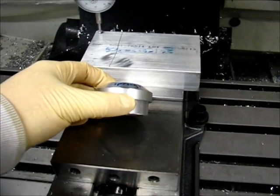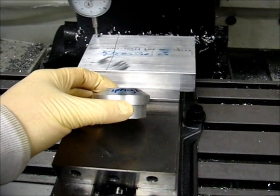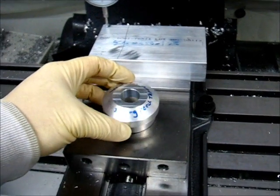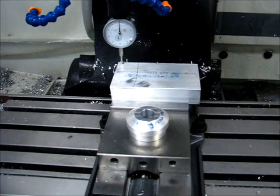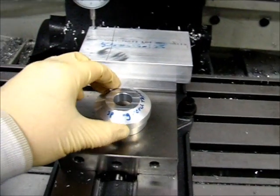I did do a waterline pass on this — waterline roughing and finishing. I think I had a 20-thousandth depth of cut or something like that, so it wasn't fine finishing. But what I wanted to do — I had some extra material — was fool around with making a shape that isn't concentric circles to see how that goes.